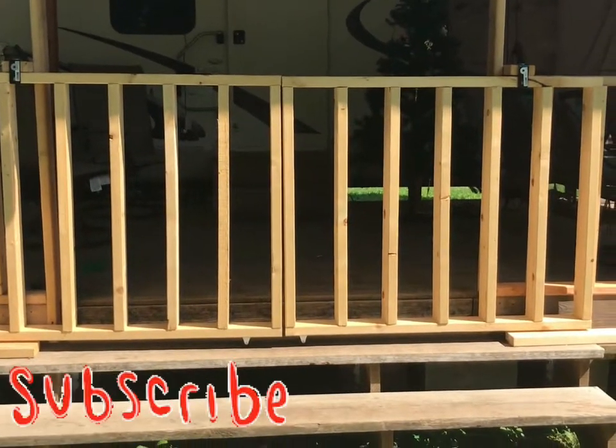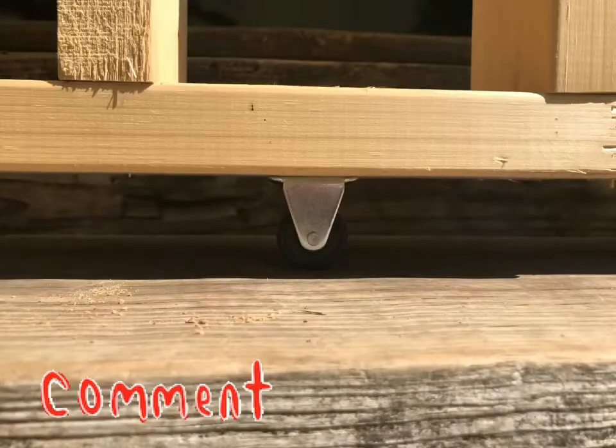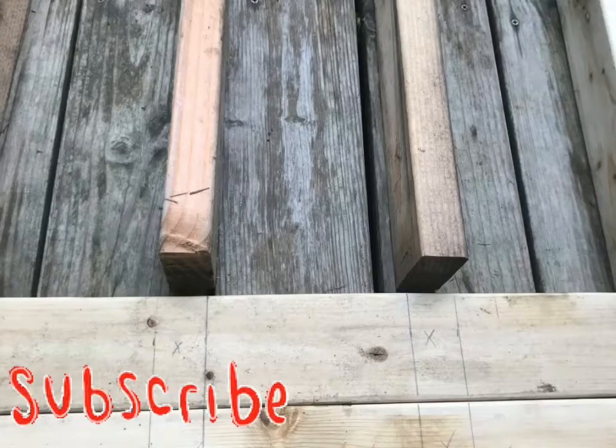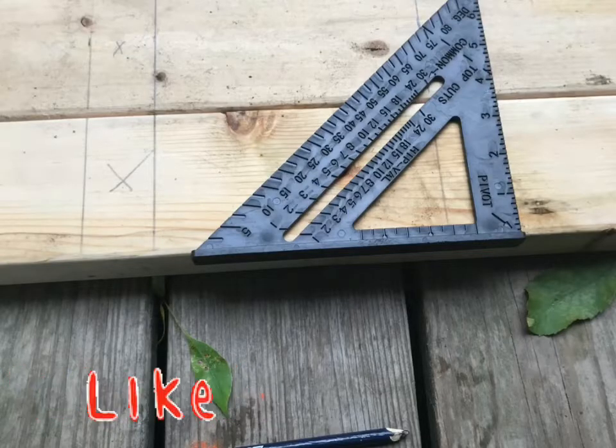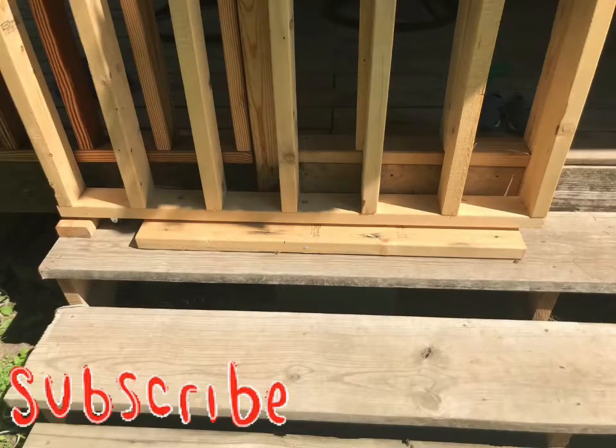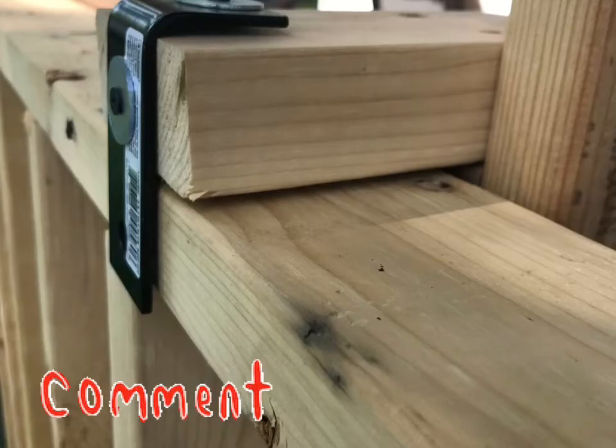Here's a quick layout on how you actually install this. Here's the rollers I was talking about, and this is how you lay them out. They're about six inches apart, and then just screwed them up from the bottom. Use three-inch screws to get some real good stability on them.